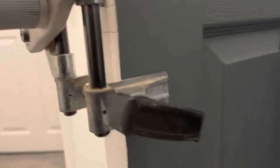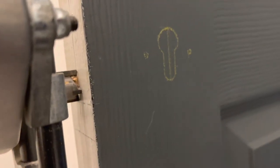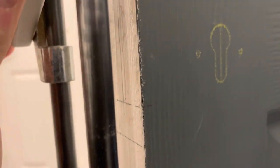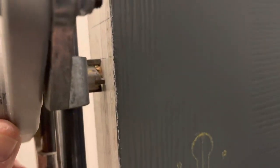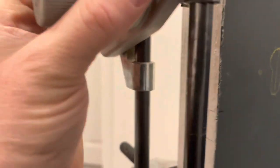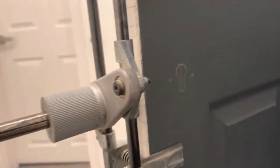This is now all set up. The cutter on the bottom there, right on the line, and then up to the line there. So that's the cutter from the mortise — that's the 19mm bit in there — and it's set up for the depth of the lock there. So let's get this cut out, shall we?